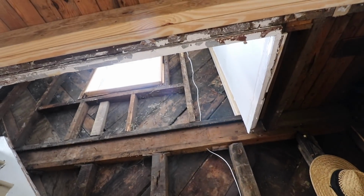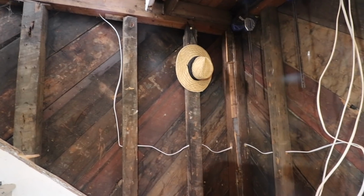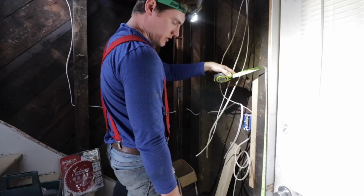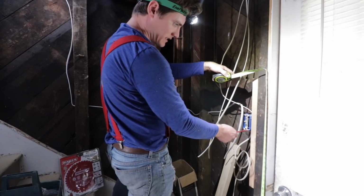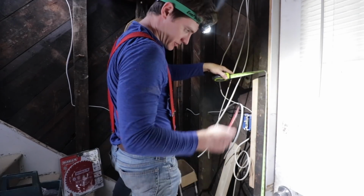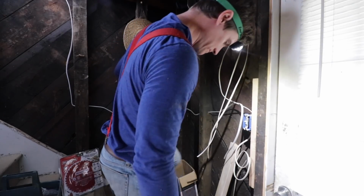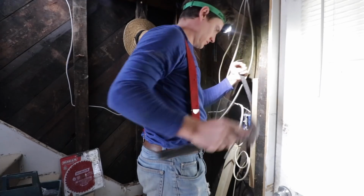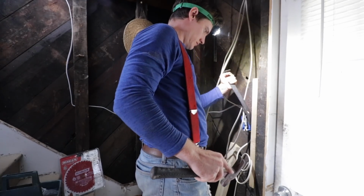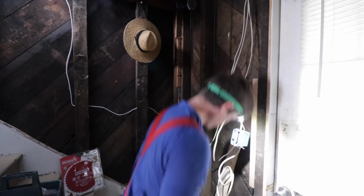And then I'll also be getting all the other wiring in the house that I had not yet stapled to the studs, stapled to the studs. Just for reference, I place all of my switches 48 inches to the bottom of the work box. I'm sure there's a range of what is normal, but that's what I put them at. And I'll end up reusing this box somewhere.